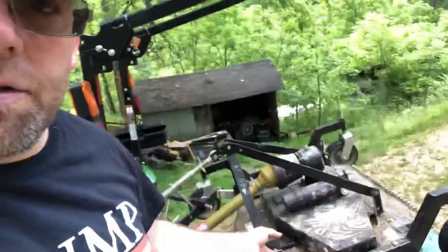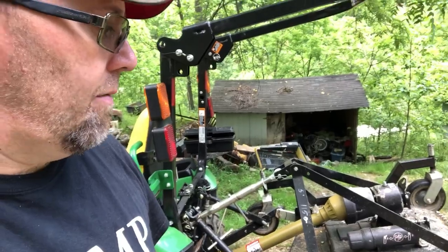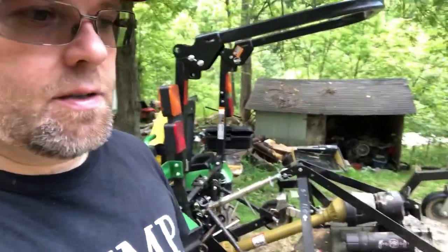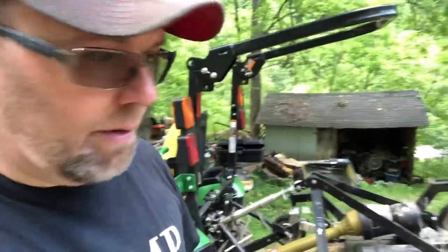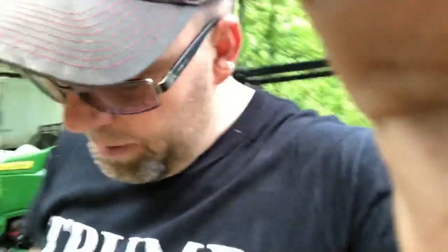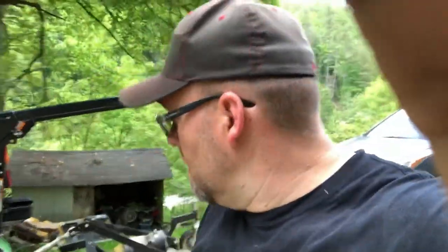I was about to give some bad reviews on this mower, but then I thought, let me raise it up and check it. When I did that, it was just bam — right there in my face. One blade was upside down, cutting with a dull — I mean, completely just like a quarter-inch thick piece of steel. No wonder it wasn't cutting. The other ones were dull too. They were turned right, but the sharp edge on them went down like a 45-degree angle, and then at the bottom was like a 32nd or 64th of an inch that was just flat — by no means sharp. It wouldn't cut hot butter. They may send them like that and the dealership may be supposed to sharpen them. I don't know.